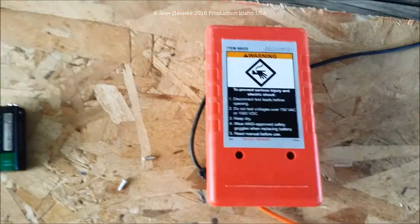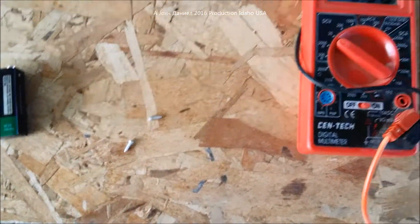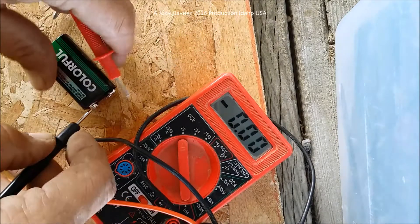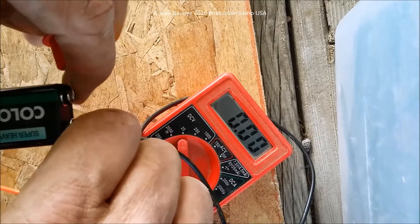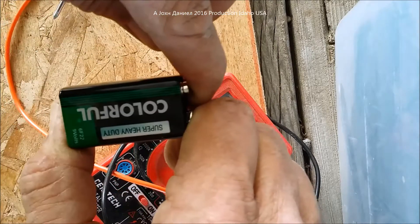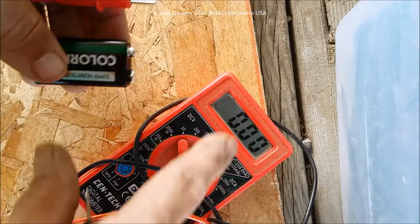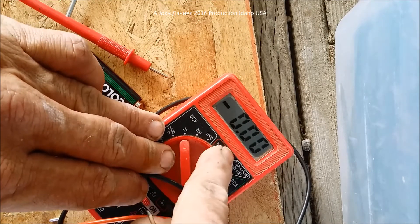Just giving you all that idea. As far as how dead was the battery — well, let's check it out. Here's the battery, here's the meter, and we have our positive and our negative. You can see it's below seven volts. Seven and a half volts is actually the breaking point for these little meters; below that it completely throws off all your measurements.